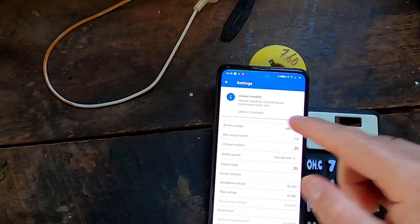We were stopping at 70–80% when hitting 3.4V, so I'm sticking with 3.45V for now — though I'm sure we'll revisit this for further testing. That's what the Off-Grid Garage is for: testing things you might not see on other channels. There is information out there on optimal LiFePO4 charge settings, but I want to test, explore, and find out what happens when we go off that path — experience it, see why it happens, then change back to what works, and explore the other direction.